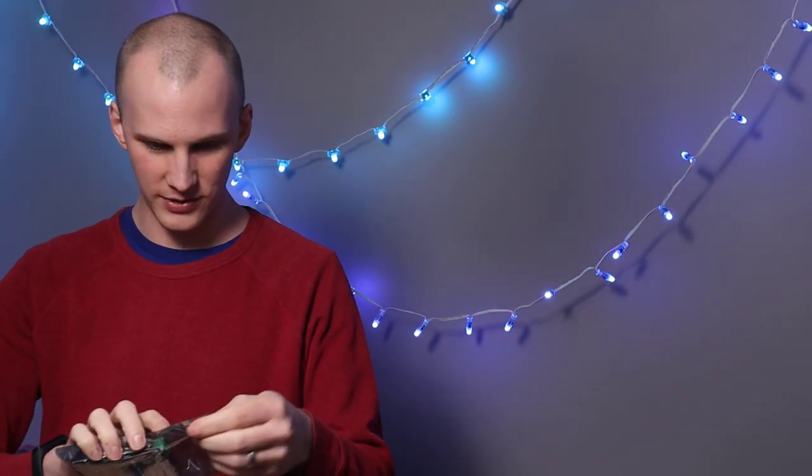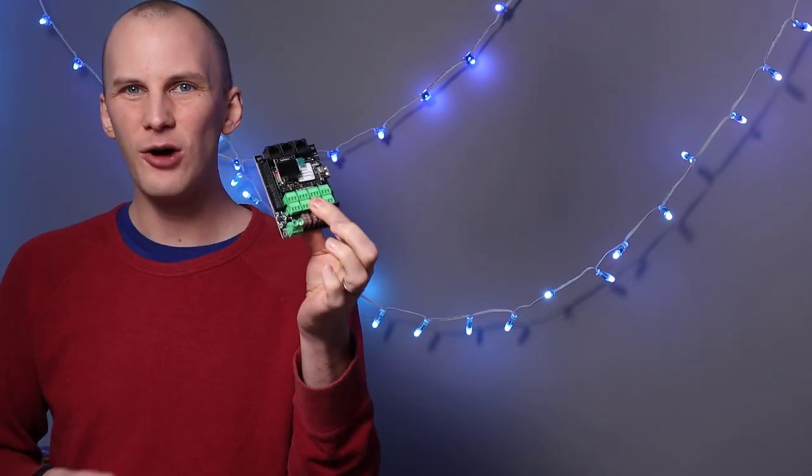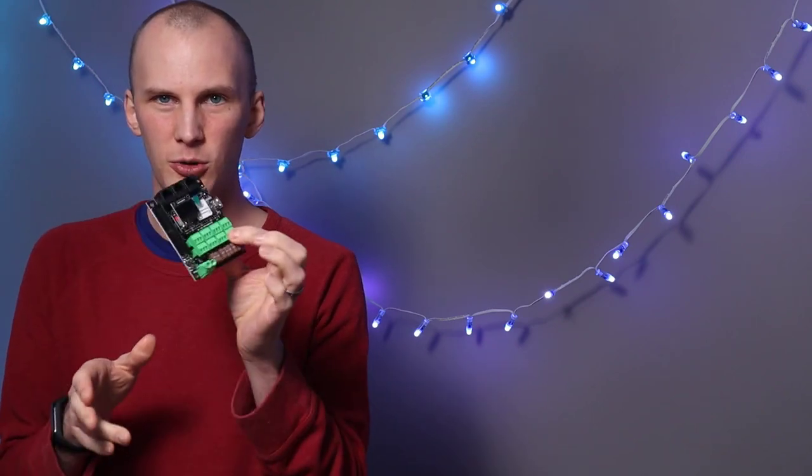As to how many pixels you should run from your controller, but in general, when you're coming off of a controller board, whether it's something like this Culp, which I'm going to open here, or a Falcon F4, or an F16, or an F48 with the receiver boards, when you're running pixels off of a controller output, you generally want to go ahead and from the output on the pixel control board, the green terminal block as they usually are, you want to get your pixels and your lights within, on data, within 25 feet. Power, often even closer to the control board.